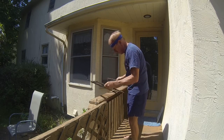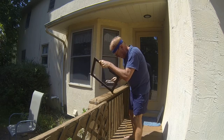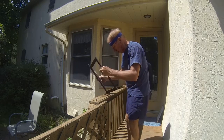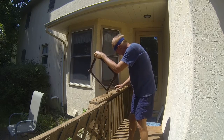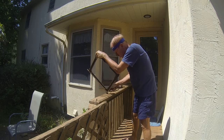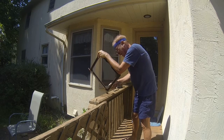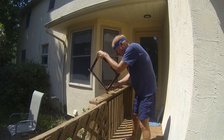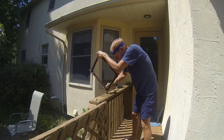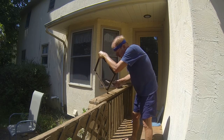I began to use the wire brush to clean off and see what I've got. There's an edge up under here so I'm going to use a finer brush to get at it — there are still rough spots. What's interesting is it can look nice and shiny, but when you go after a spot that looks rough with a chisel, it suddenly turns rusty again because there's some shiny iron on the outside but rust has gotten underneath and bubbled it a little. So any rough spot is an indication that there's rust underneath and you need to get back in there.